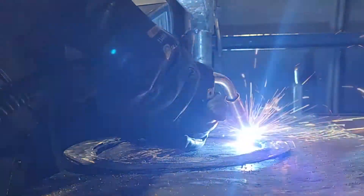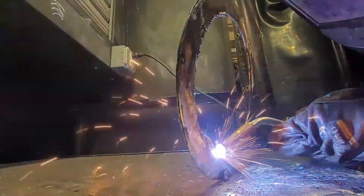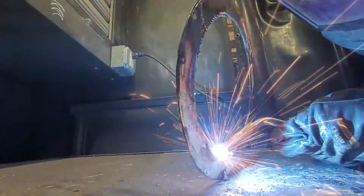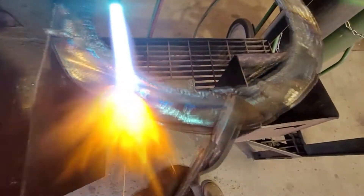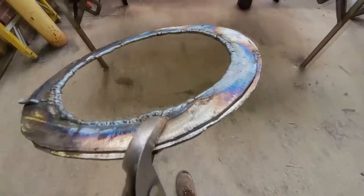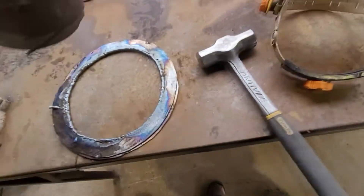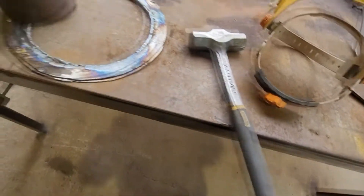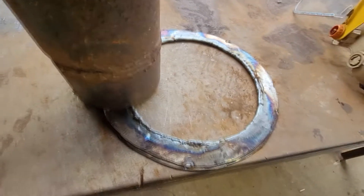Most importantly these spacer rings need to be flat. Every time I cut them out and grind them they warp a little bit, and every time I weld two together they warp a little bit. I stacked two per side so they'd take up even more of the gap, welded them into one giant ring, and then had to put them under the torch and do some blacksmithing - hit them on the table until they were flat, because these things need to be kissing really well for the gasket to work.